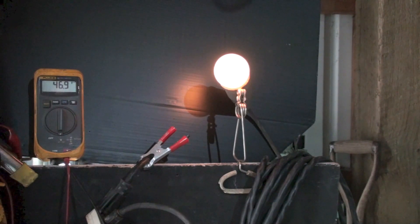I'll do some calculations to show you the impedance of that circuit. You can see the trend: at 120 volts I was getting virtually nothing, at 240 volts I actually got the light bulb to glow a little bit, and at 480 volts I actually got a little bit of power through it. I'm still running less than half an amp — 0.29 amps — so our resistance is pretty high.